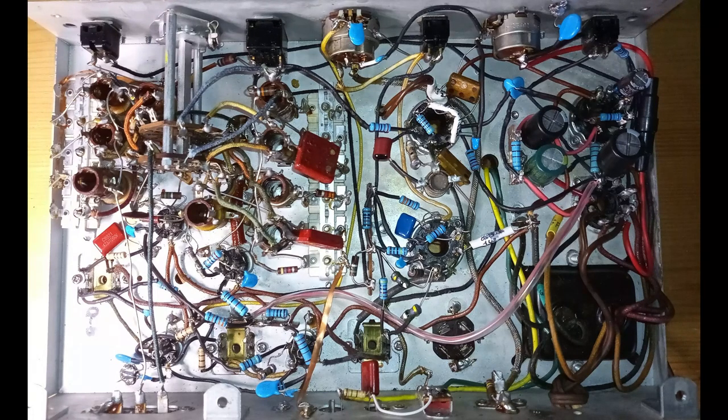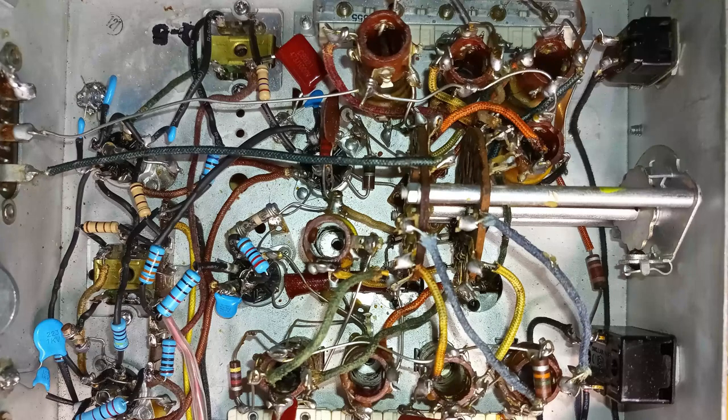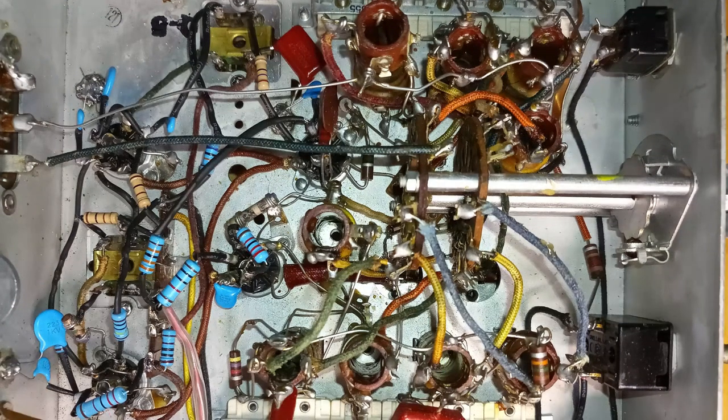The electrical restoration under the chassis is completed, leaving alone the radio frequency section, where the components seem to be still in good condition. In particular, generally, the ceramic tubular capacitors and the low-value mica capacitors should not be changed, unless they have to, because of a verified failure.